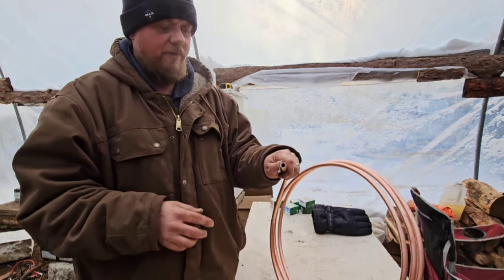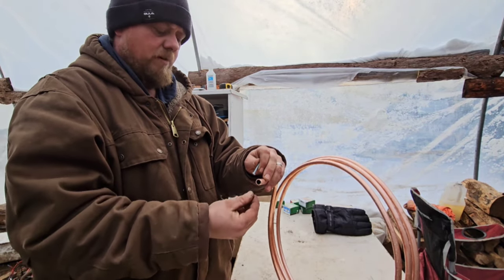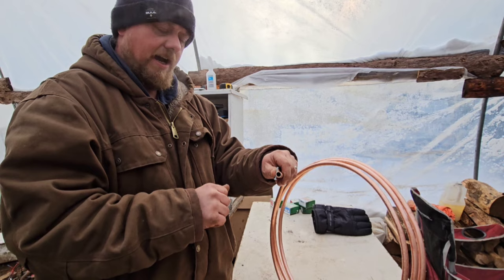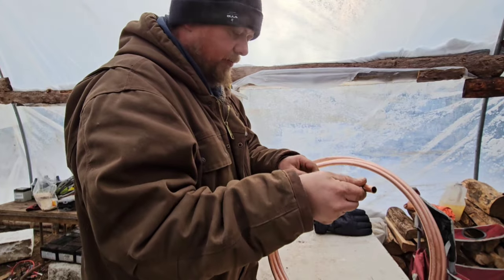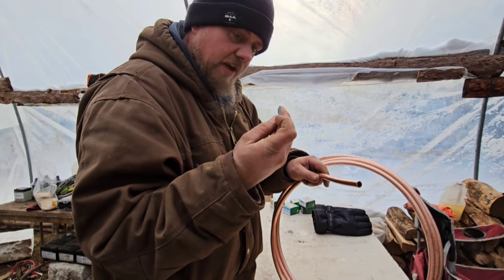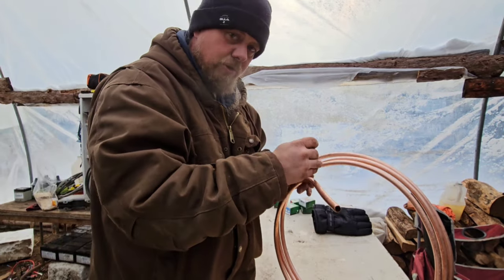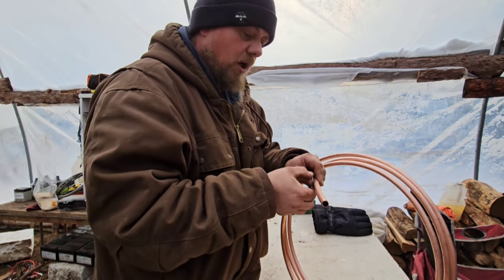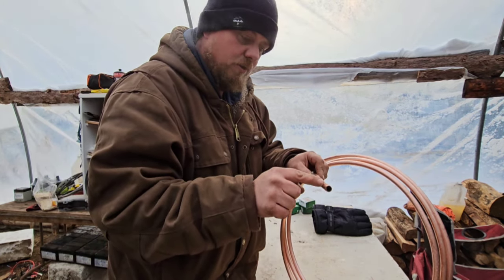The thought is I'm going to use a washer on the bottom to keep the head from pulling through too much, then a locking washer and nut on top. The wire that comes off of this is going to go to the battery. This tube — however long, I haven't decided yet — will have 50 of these for the negative and 50 for the positive. So you can do 50 in one tube or bus bar and then 50 in the other to create your bus bar system. How many batteries you have, if you need to expand or take any out, you'll want to have available spaces.